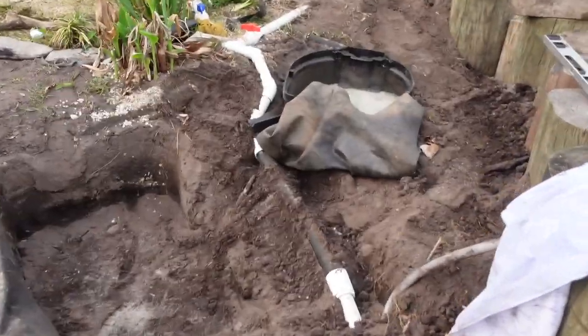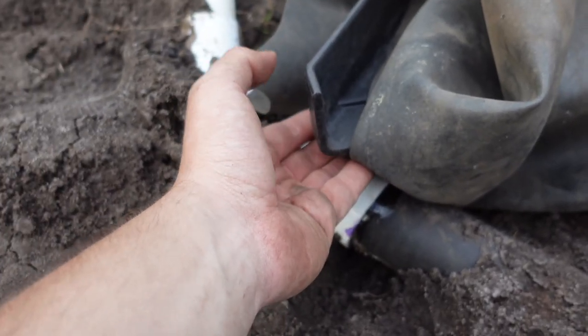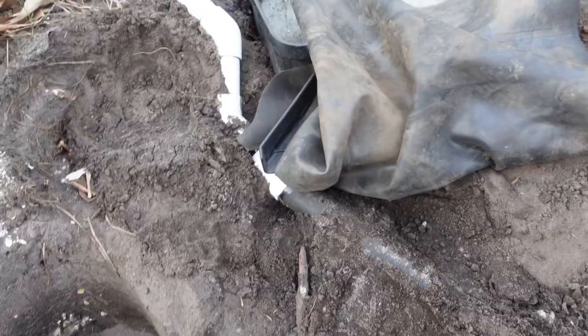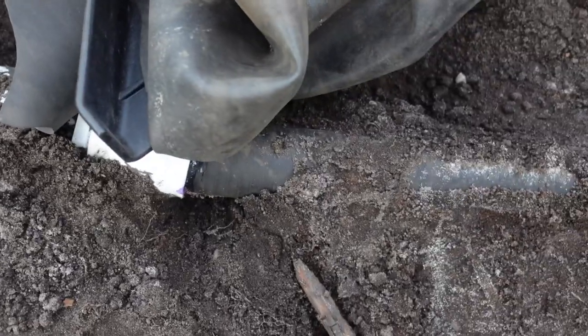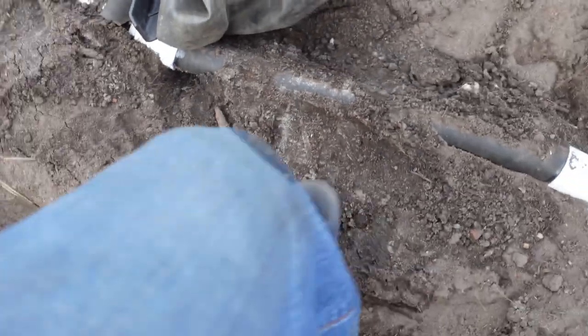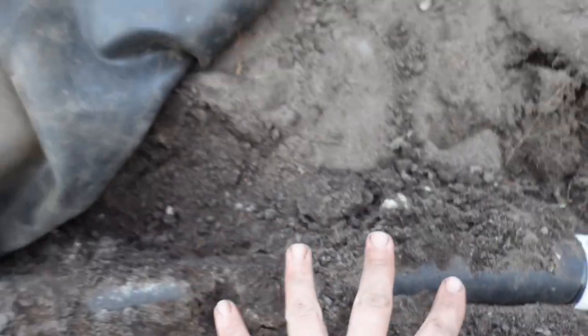The issue was that this pipe right here was connecting continuously with the pipe up here, but it was hitting something and being raised up, so it was not level. I needed to get it level so I could start backfilling. What I had to do was reroute a little bit and use a piece of flexible hose with a small adapter so that even while it's running, once it's glued in, I can move it and it will not leak at all.